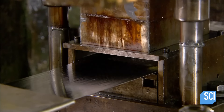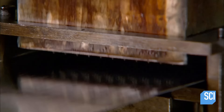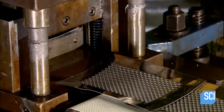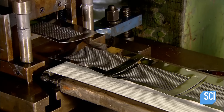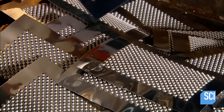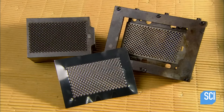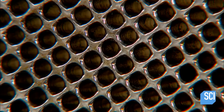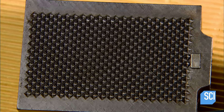The blades are made from a stainless steel sheet that's just 1/50th of an inch thick. The sheet enters a shearing machine where a die descends and cuts the blade shape, holes and all. The machine's dies are interchangeable, so when it's time to produce a different model, workers simply remove this die and install another one.